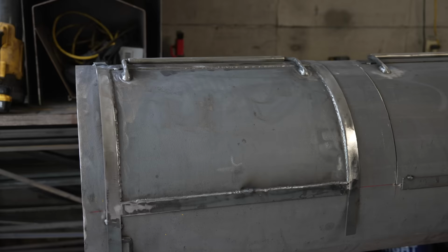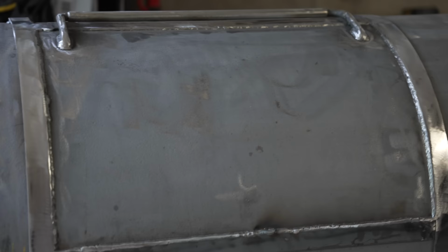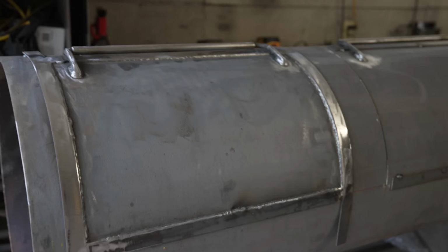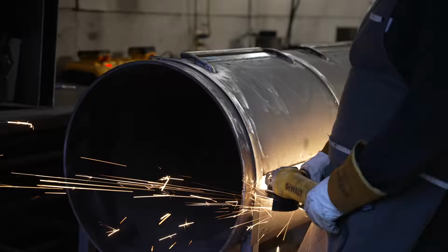So at this point, I went around and I did full welds all the way around the exterior, and then my welder overheated, so I decided to take some time to shine up the metal bars a little bit. And now this whole door is piping hot, which is why I tack it closed, because it could warp. So I'm gonna let this cool down for a while before we zip those tabs off.